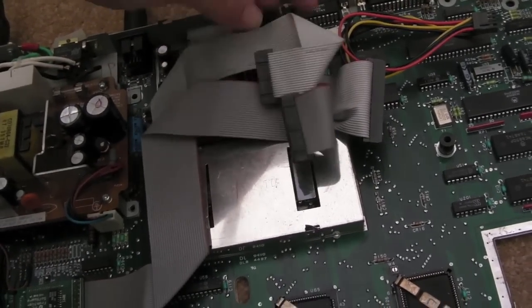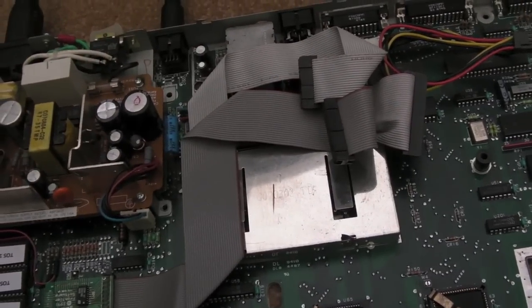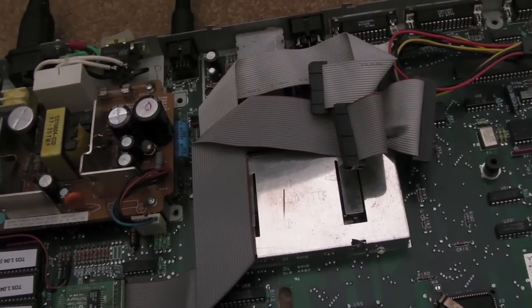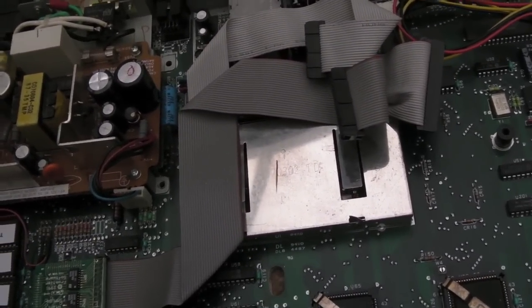The reason being is because I've got my RAM disconnected. You can see this is where the Marpet normally goes, these two headers here, and there's usually a switch. But yeah, that's what you get when you've got no RAM, or you've got RAM faults, or something wrong with the RAM - the address decoding or something related to that.